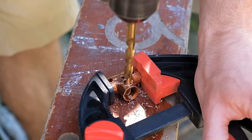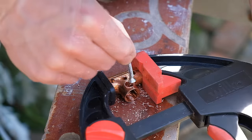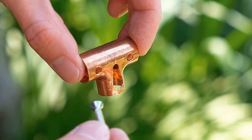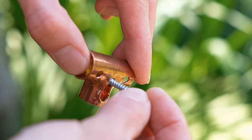Now we can take just one of them and drill two more holes in the middle, but this time expanding the lower one enough for a screw head to fit into. They can now be bridged with a file, giving us a biting system that will very securely keep the light in place once it's hung on the wall.